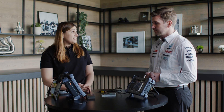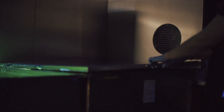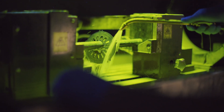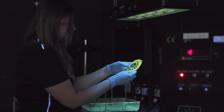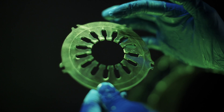It seems like quite a labour intensive process. Is there a way we can automate this, or test numerous components at one time? We've got other methods in NDT. One of them is called DPI — dye penetrant inspection. Numerous components can be put into the fluorescent liquid, sitting for a set amount of time to ensure the fluorescent gets into the indications. Then we wash off the excess, dry the part, and put it into a special dust cabinet containing developer that draws out the flaws. We then inspect it under UV light — if there's a crack, it will be illuminating.